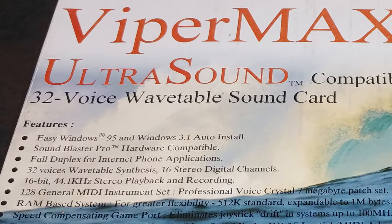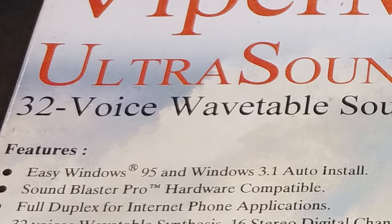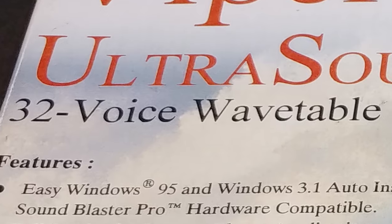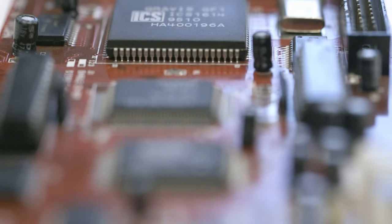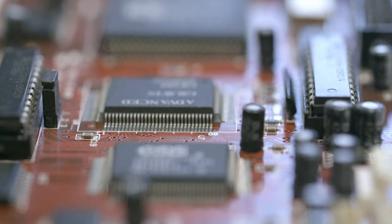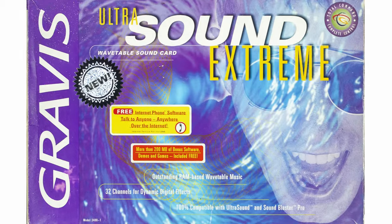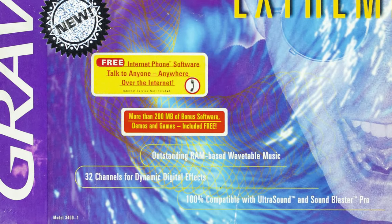Even though it is able to play up to 32 channels simultaneously, the problem is it is able to play only 14 channels in full resolution. With more channels than that, it lowers the playback rate with each step. For example, when playing 20 channels, the rate is about 31 kHz, and when playing all 32 channels, the rate goes down to 19 kHz.